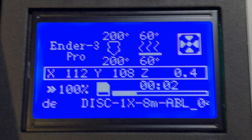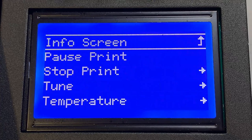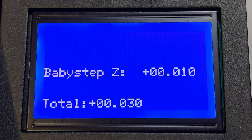Let the print continue. When we click the wheel three times, it will enter the Baby Stepping menu. You can now adjust the nozzle to be closer or further away from the bed if necessary. Sometimes when printing thicker layers we may move the nozzle away, but when printing thinner layers or wanting filament to be squeezed on the bed, we can move the nozzle closer to make it stick better. Since we enabled Baby Step Display Total, the total offset adjusted is shown at the bottom left corner.